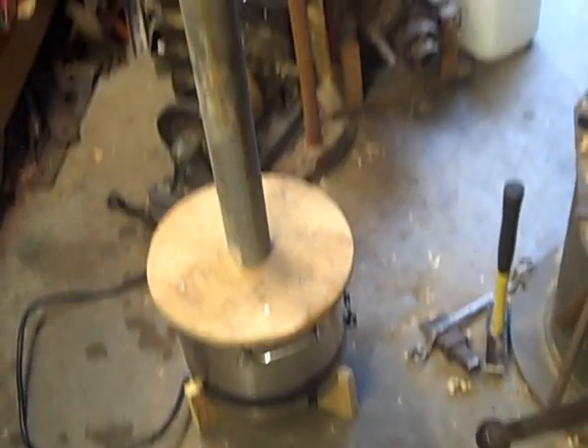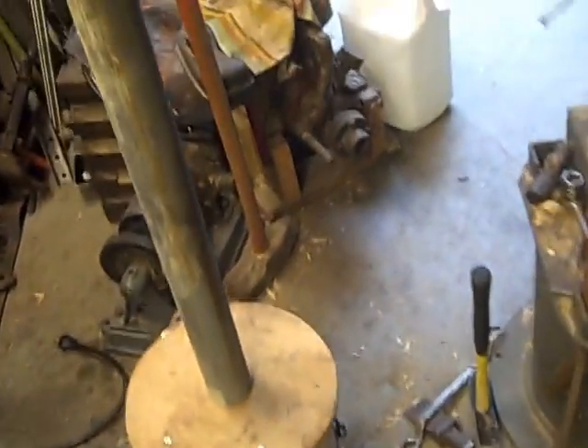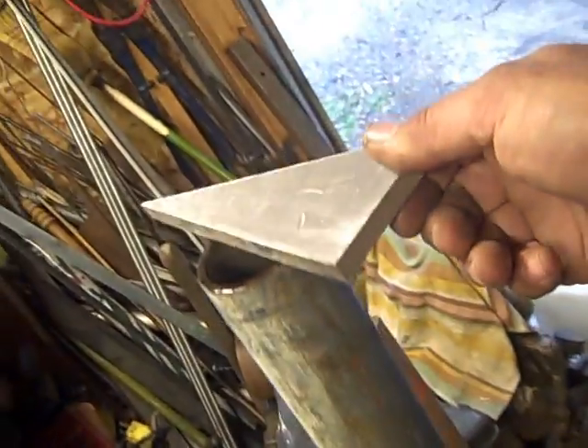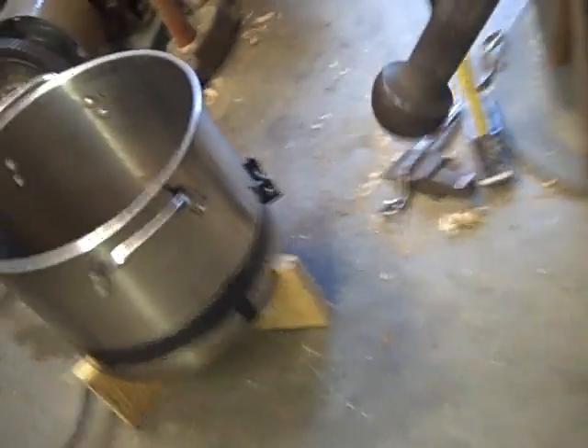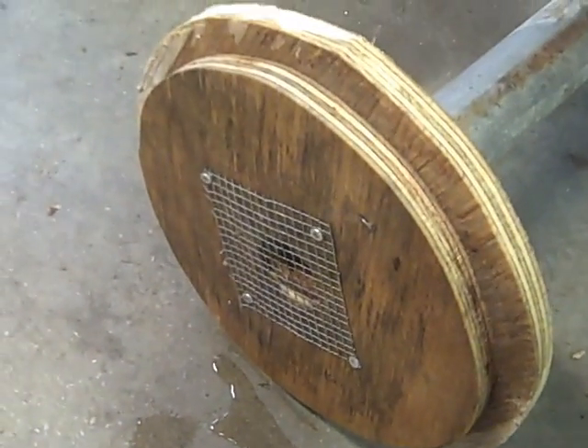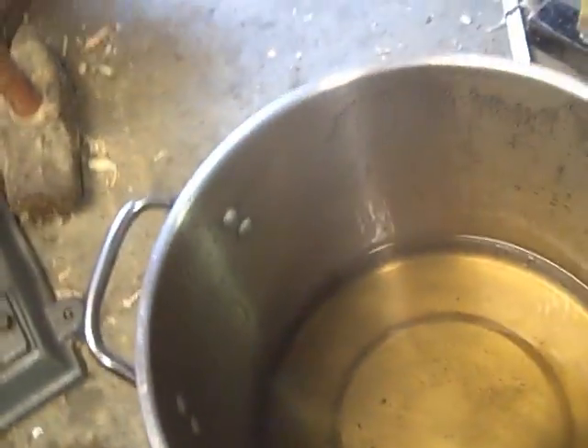Here's the setup I used to steam. This is a galvanized pipe — I think it was used as a roller — and just a hunk of aluminum to keep the steam in. So essentially I have two concentric pieces of wood and a piece of screen to keep the thing from falling down. There's the pot — it's a two-gallon soup pot. Underneath I have an element.